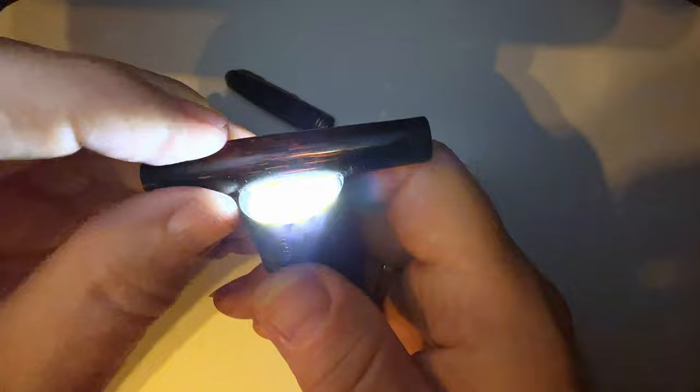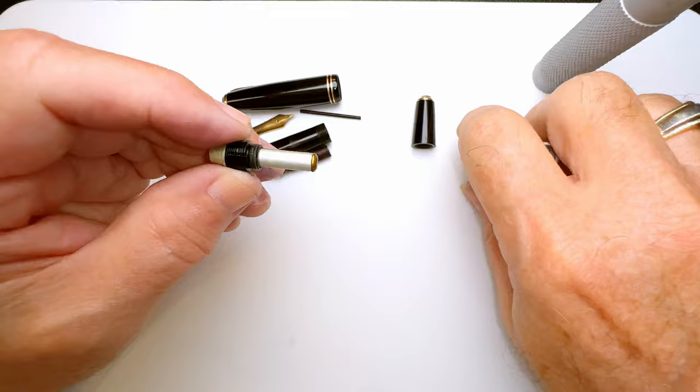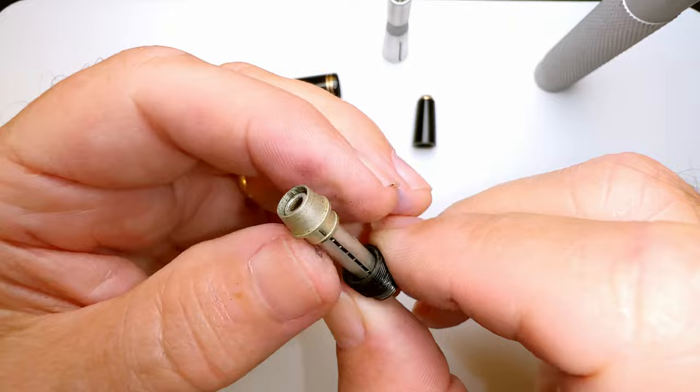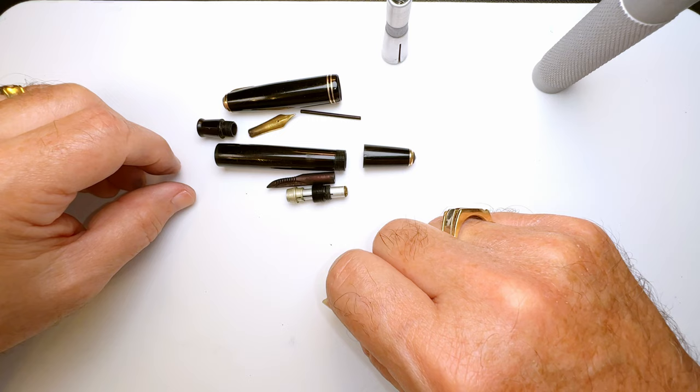You can see that the translucency on this one is horizontal stripes rather than the vertical stripes of this barrel that was made in Canada — I find that very interesting. Now I just unscrew that end and tap the collet out. There's our speedline filler and the spring in there is very nice. The whole thing looks very, very good. I cleaned off all the old sack and it's working nicely. I'm going to re-sack that, polish up the cap, the barrel, the blind cap, and get that nib polished up, then put the whole thing back together again.